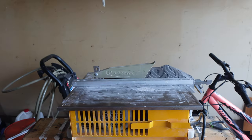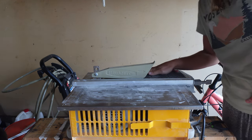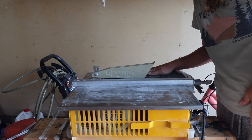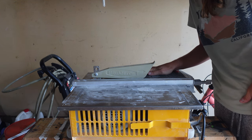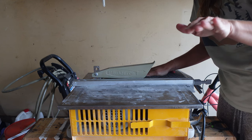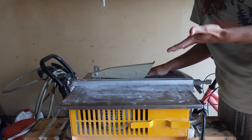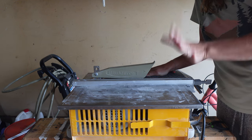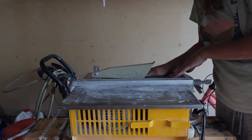We are going to make our inaugural cut with our wet saw. For tile jobs, it is recommended that you use a wet saw with a diamond blade, which is what we have. We're going to use pieces that are cut flat along the bottom to sit on the countertop, because it's just going to be easier to work with a flat piece that we can sit right on there and build off of.